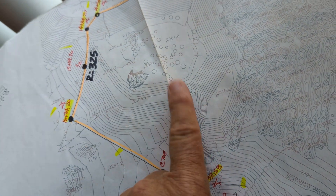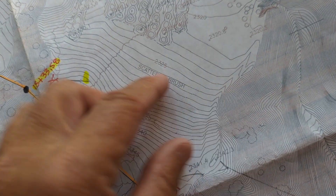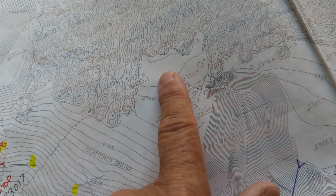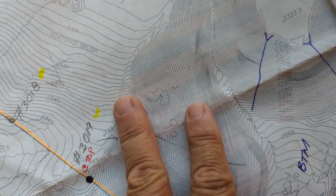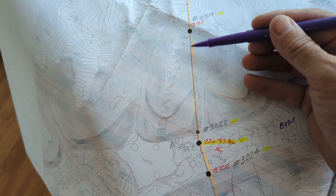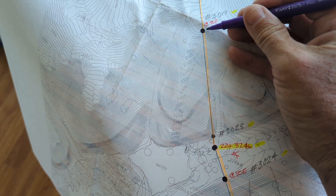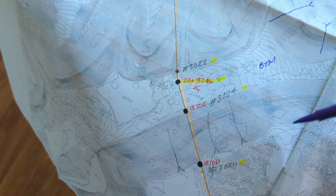This is all natural ground, this is a man-made basin. You can see this natural ground here - since the contours are kind of wide apart, it doesn't have that much of a slope. It starts slowly sloping this way. The tighter the contours, the steeper the grade. This area here is almost vertical - probably a one-and-a-half to one, or one-to-one - and it was very brushy.